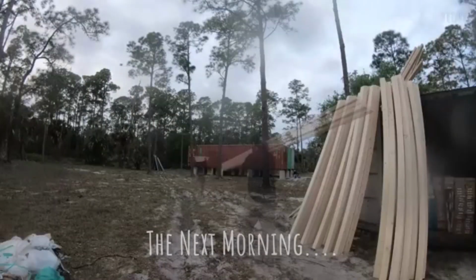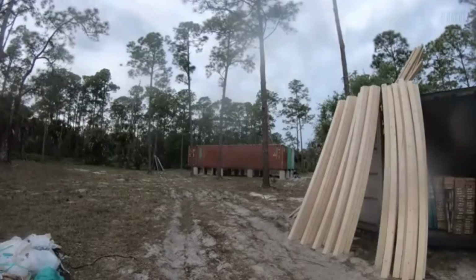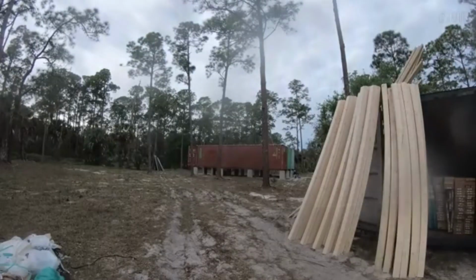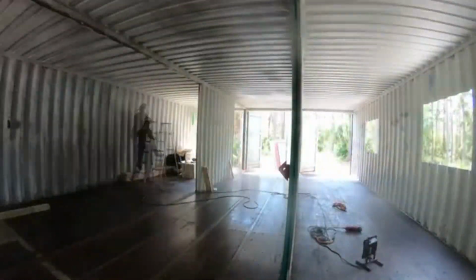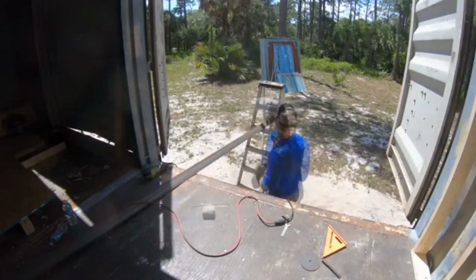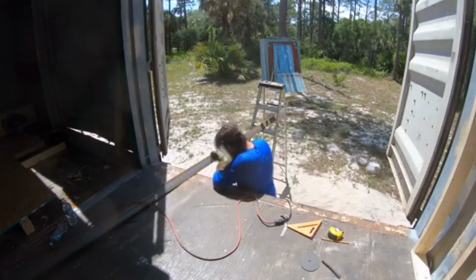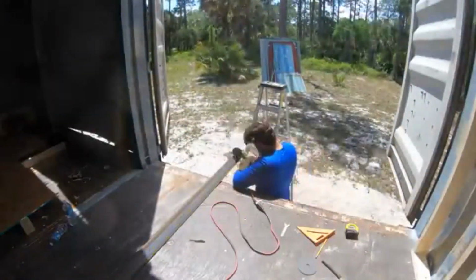So we've arrived at another very big and important day. Today is window outline, trace drawing, and eventual cutting out of the windows. You take your angle grinder and cut the hole. So all 5 windows are cut out. But when you cut out a window, you have to reinforce it. Here we have our angle iron, 2 by 2 by 1/8-inch thick angle iron.